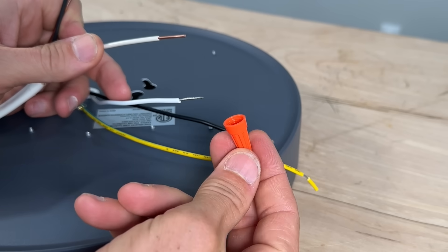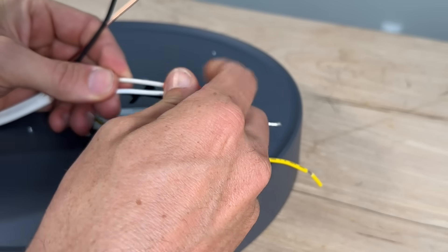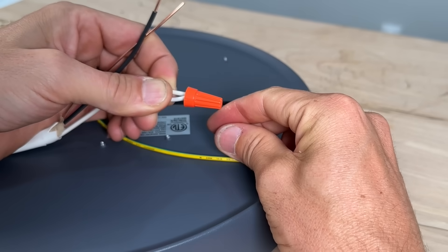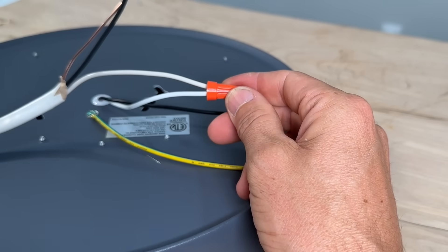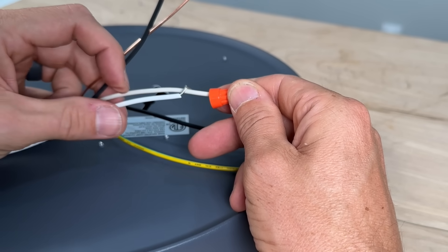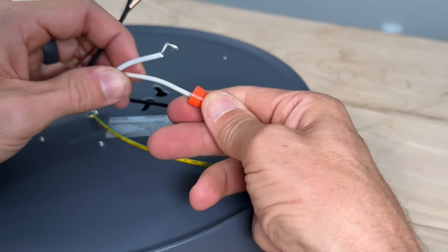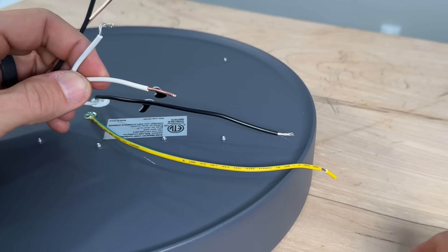The default condition is you just take small generic wire nuts, place both wires in, and start to twist. You feel the wire nut biting and getting much harder to twist, and many of us would stop at this point thinking everything is good. But when you do a pull test, you can already see that although the stranded started to wind around the solid, it was by no means a solid connection — because the wire nut is actually just biting on the solid.